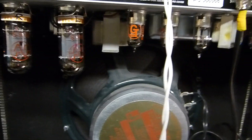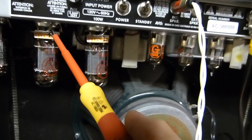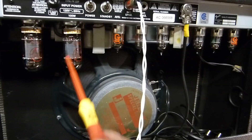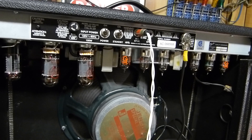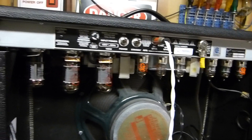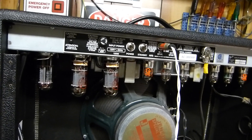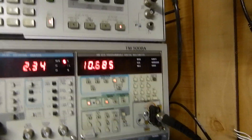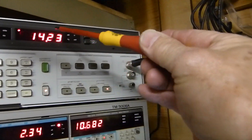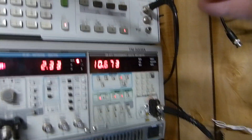I've got one tube here labeled as 'left' and this one labeled 'right.' This one was on the left, this one was on the right, and I took some pictures of it. Everything's working great right now — here's its sine wave output, here's its voltage and power across eight ohms. You square that voltage and divide by eight and you'll get that power number.